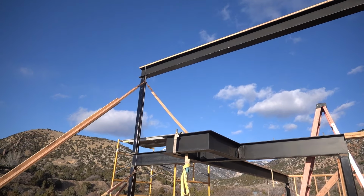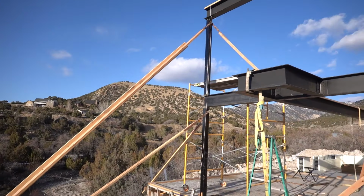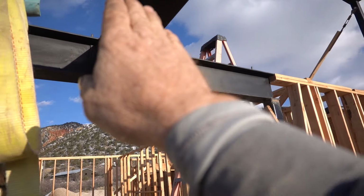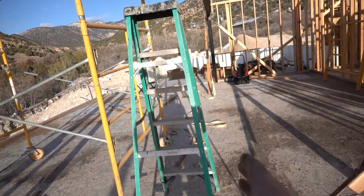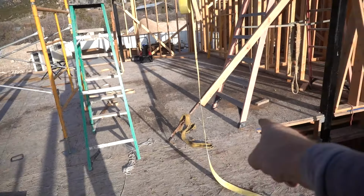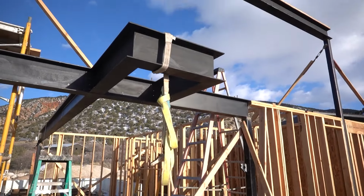So that carries the upper roof. Trusses are gonna land up there. They're gonna land on this wall when I put it up, up there. But this is my cantilevered, the stairs. Gonna have that single stringer going down here. And I wanted to cantilever. The problem was, with this, I would have had to have a post right here. So all of this steel came from eliminating that post. Now I'm free span open. We got our kitchen and our island and all that. No more interior walls. This is so stinking cool.